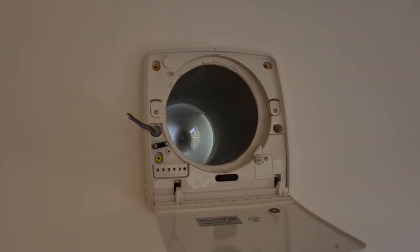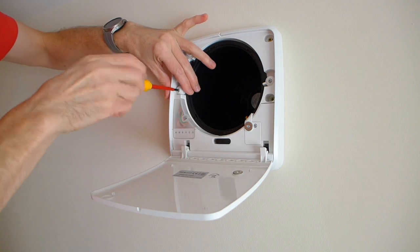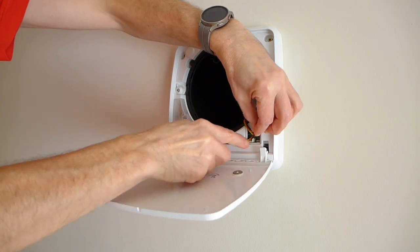Stick the soft muffler onto the inner part of the external cover and fit the whole external cover assembly. Mount the internal part of the unit, terminate the supply cable, insert and lock the motor assembly, then connect to the pin terminal.